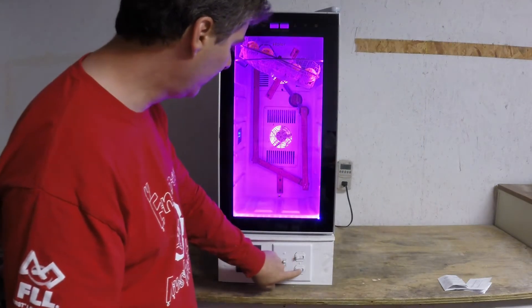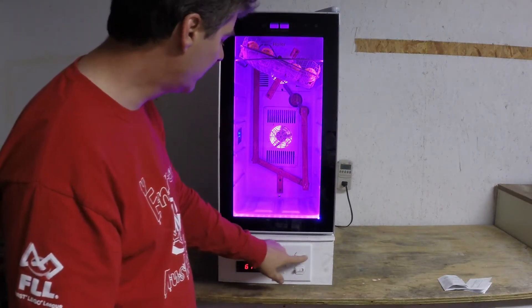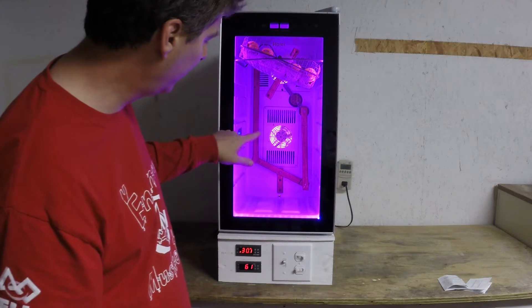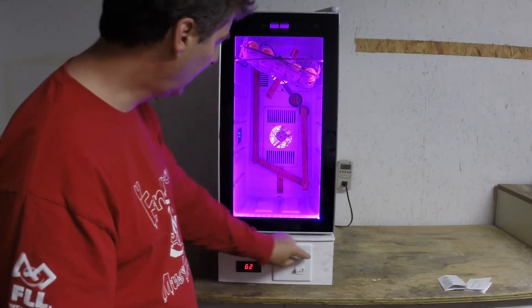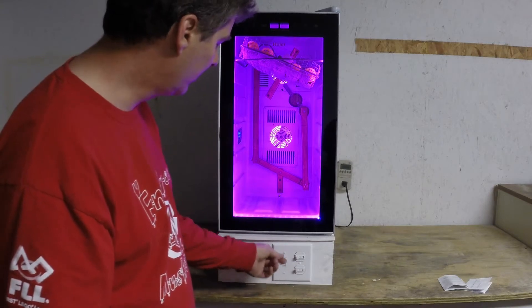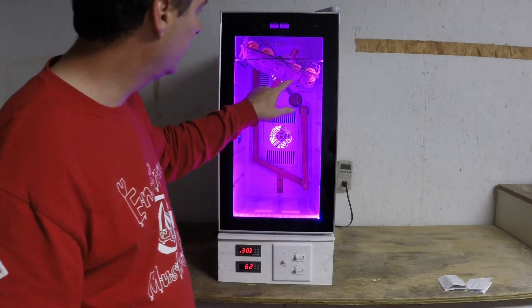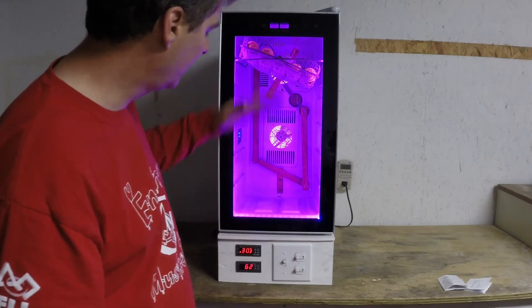Up front we've got five of them. We've got the LED light so you can see inside. That one's the fan — there's a pusher fan and a puller fan to circulate air for the forced air system. This one here turns on and off the motor, so in the last three days when the eggs are about to hatch, it turns off the rocking so they don't rotate.